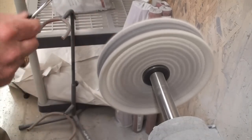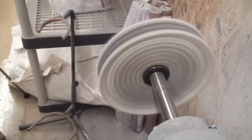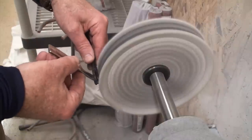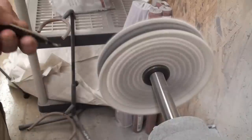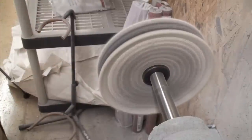You're getting what — 60 razors a day? Well, not a day. I usually do between 100 and 150 a week. That's a lot of razors. The problem is not so much honing them — it's testing them. Because I just want... you only have so much beard to shave. I can test between a dozen and 14 or 15 razors tops, because I segment off my face. And it's got to cut a specific way that I'm comfortable with. If it doesn't, it goes back into the re-hone or touch-up batch for that day. No razor leaves this joint until I'm comfortable with the way it shaves.